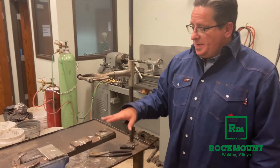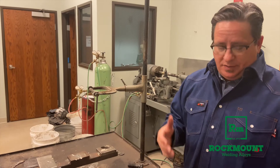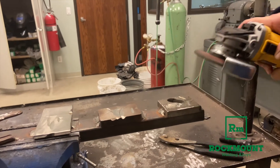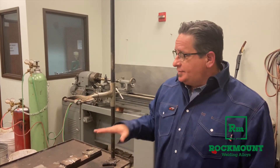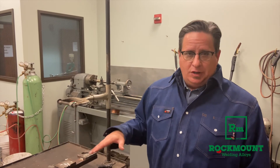Not all stainless steels look like stainless steels when they've been out working a lot, so it's important to be able to identify that. Now we're going to grind on zeta — this is a piece of zeta plate. As Larry Brown would say, that stuff is harder than woodpecker lips. When you grind on it, there was very little spark coming off of it, very little red. That indicates a high chrome content, which gives it a lot of hardness. So you can know what each of these metals look like and determine a little about their alloy content by doing a spark test.